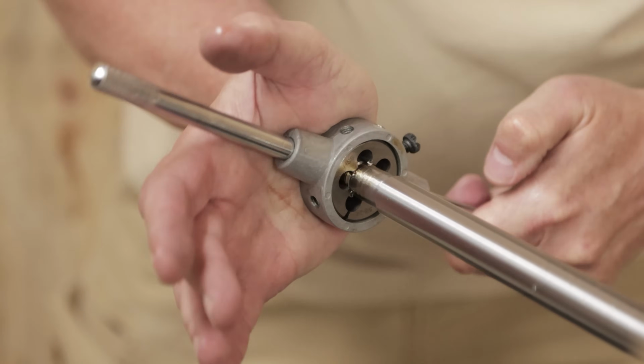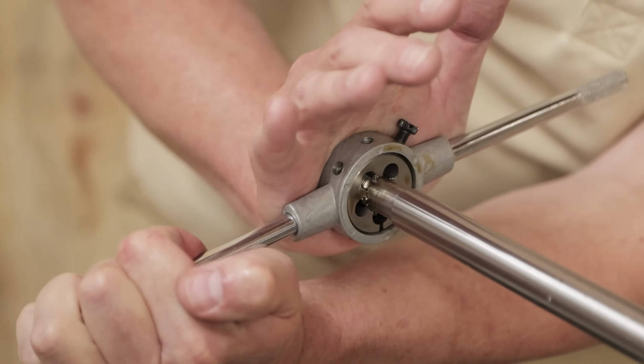Yeah, and the interesting thing about the annular cutters is, they weren't made for this purpose. It's something somebody went, oh, this industry has this, I'm bringing it in. Right. And so they might be off by 0.005. But that doesn't matter. If you keep the thread alignment tool there and everything, it will cut that little bit of extra material, no problem. Nice. And I occasionally will get a question from somebody, I don't understand, this is 0.005 over, 0.010 over, so you have to have that conversation.